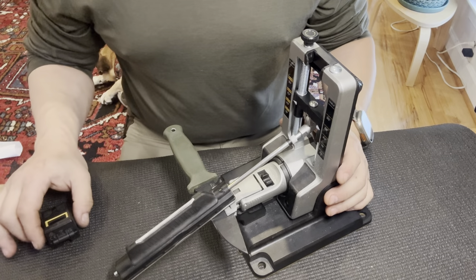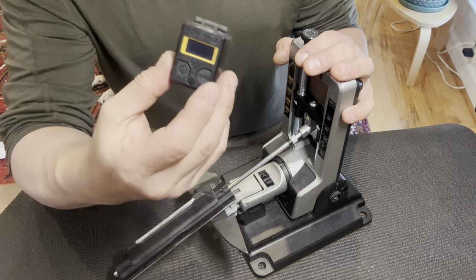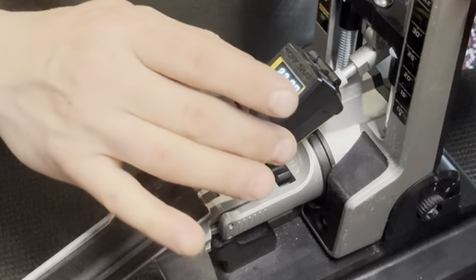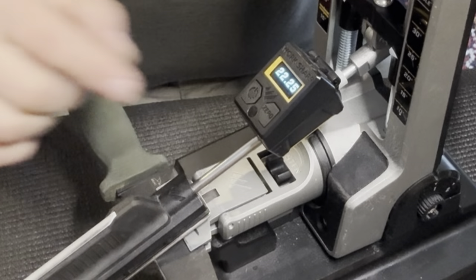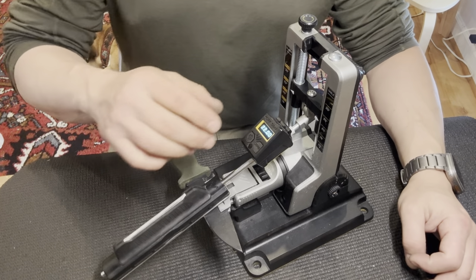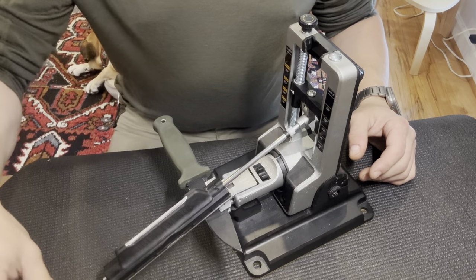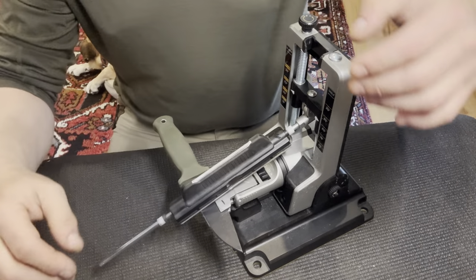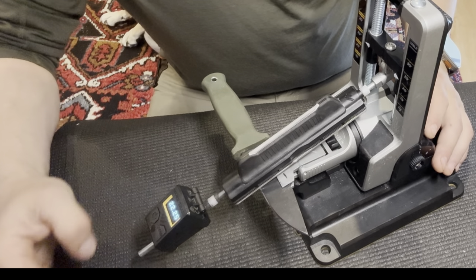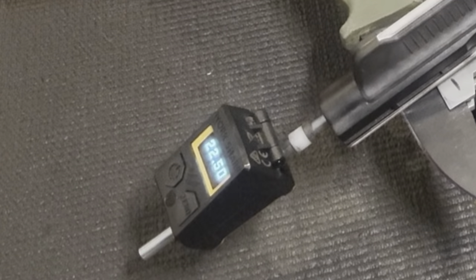After at least 30 to 35 sharpenings. As you know, the WorkSharp Precision Pro comes with an inclinometer or angle finder. I zeroed it out to the frame and then I throw it on this rod. Sometimes I tap it a little just to make sure it's reading correctly. This inclinometer is only capable of reading a quarter-degree minimum, so it adjusts in quarter degrees. For this to be consistent, the angle on the top should be the same as the angle on the bottom. And as you can see, there is a quarter to half-degree difference there, which is significant.